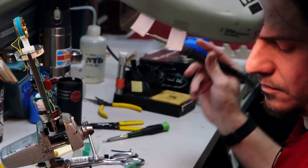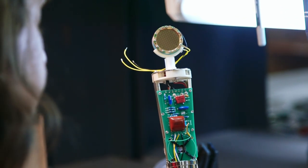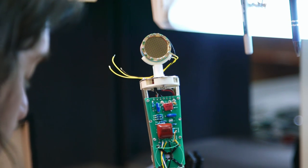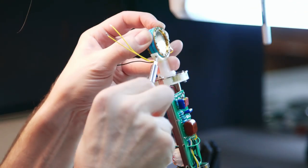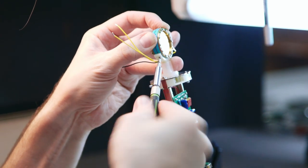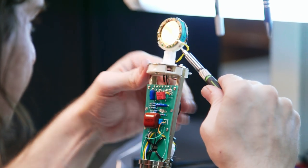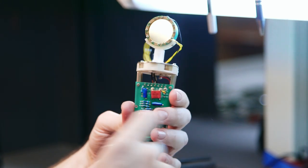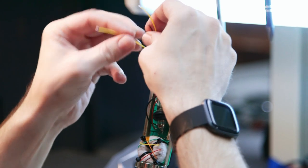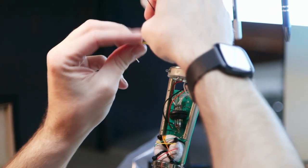Can you describe the capsule? It's a CK12-style capsule — you'll notice it's not center-terminated; there's no screw in the middle, unlike Neumann-style capsules. This is a CK12 style, which is what AKG CK12s and Telefunken 251s use — they're edge-terminated. This mic has a little dip from 5 to 8K and then a really big rise above 10K, which gives it that airy sound and makes it great for handling sibilance. That's opposed to the K67-style capsule used in the 200s, 300s, and FET mics, which has more of a rise from 5 to 8K — so those are a little more present, this is a little more airy.